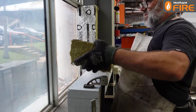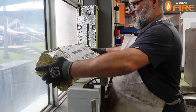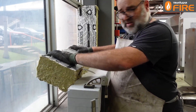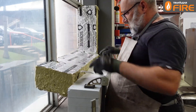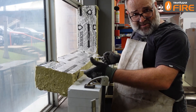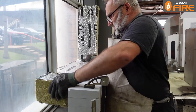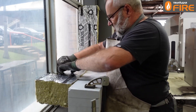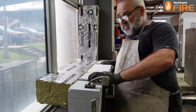Just checking on that cutout for the mullion — that looks nice and tight. The trick with the Siderise is to get it into position: if you roll it, you can see it's starting to compress into the opening. I've got my angle brackets in already, because they're going to be pretty tricky to stab in once the CWFS is in there. So I'm going to push it in with compression, make sure everything's nice and tidy, and I'm ready to dynabolt the brackets onto the slab.